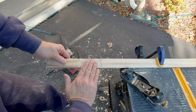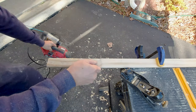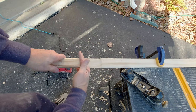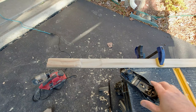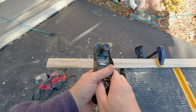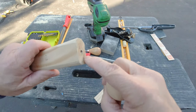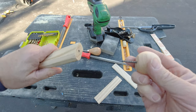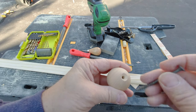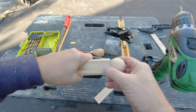I did the handle first and then used the hand belt sander to grind down to the lines on either side. This is the most important transition because you're going to bring the guard in here and that gives you a target for the plane — the plane really takes away a lot of material, so it's the most efficient approach. For the end, I found the center hole, pre-drilled it for a 2¾-inch long screw, drilled through to the end of the doll head, beveled it out, and pre-drilled it so it will go in — that will help keep the guard in place.